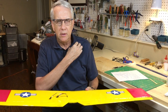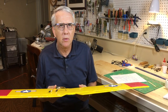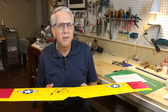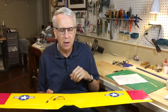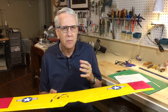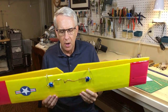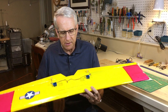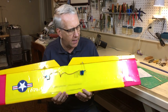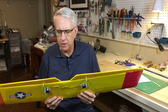As you can see, the Rocketeer flies great — very similar handling characteristics to the Foam Bug. Both planes weigh about one pound two ounces, which is pretty light for an airplane of this size. It has plenty of power with an E-Flight Park 370 electric motor off a two-cell LiPo. I fly most of my flights at about half throttle, so any motor that works for a plane a little over one pound should be suitable. Due to the ease of construction of foam board, you can make a fairly lightweight model, which I think contributes greatly to the success of any flying model. The two wing halves are joined the same way, with drywall reinforcing tape and popsicle sticks at the centerline.